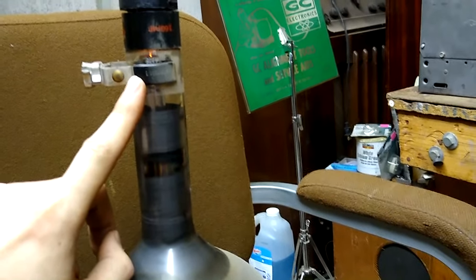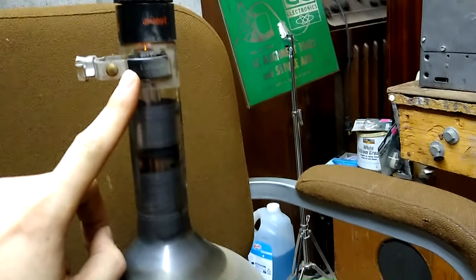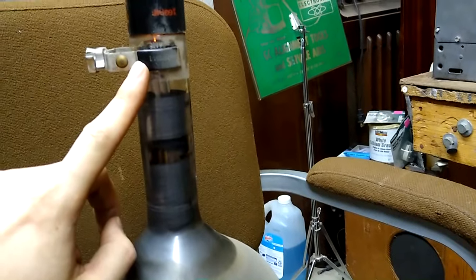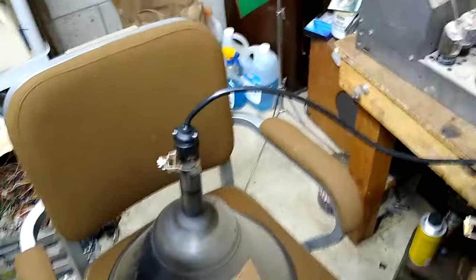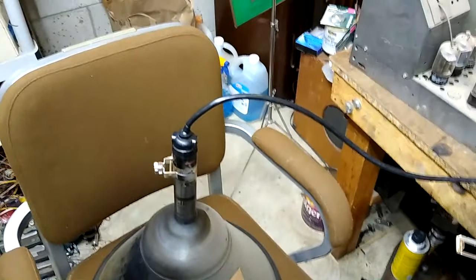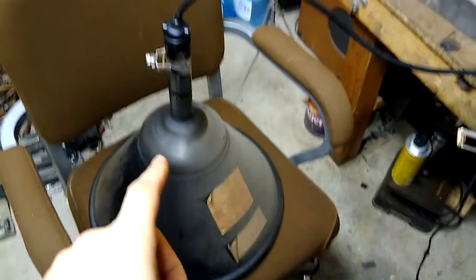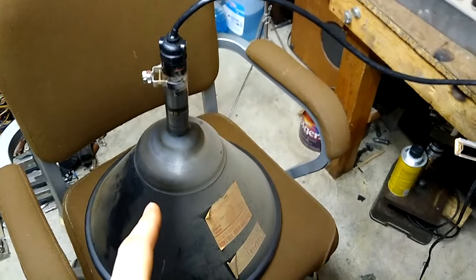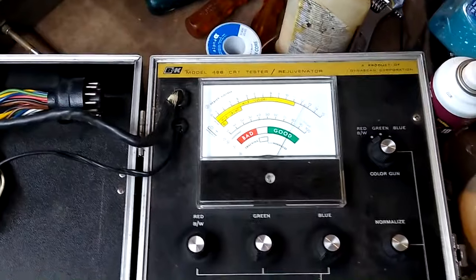In the case of the Zenith Coburg, I left it to sit for about 2 days, and it amazingly came back from being stone dead. The Zenith Coburg was so stone dead that when I bought it, I let it sit for about 5 or 10 minutes, and I couldn't get any emission deflection out of it at all. This tube was asleep, but it came up over somewhere between 2 and 8 minutes of runtime to the good status it's in right now.